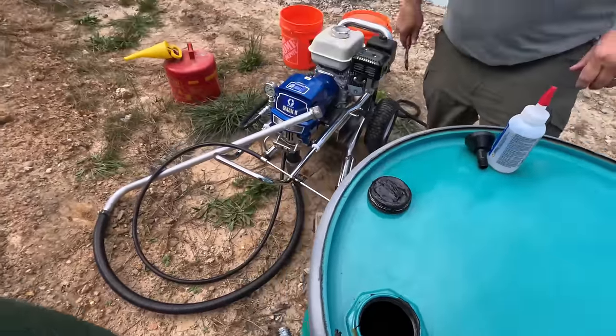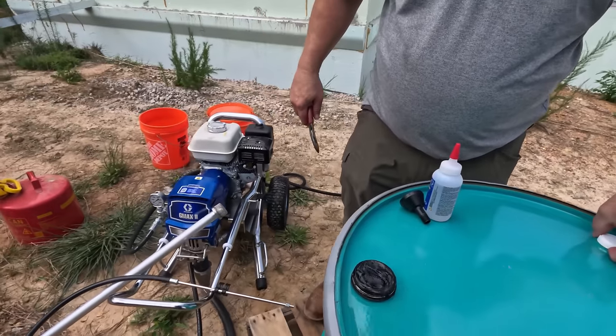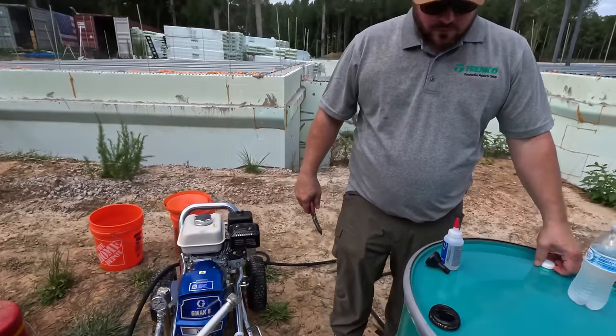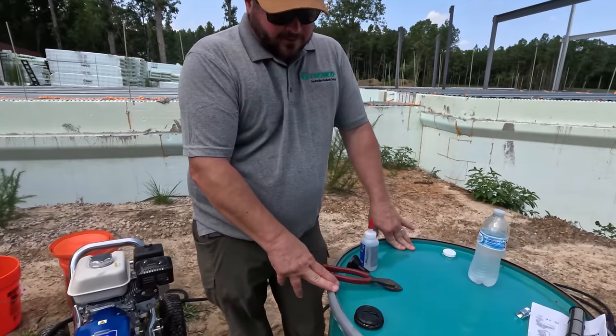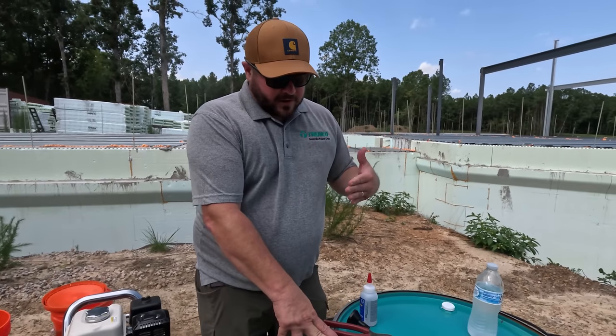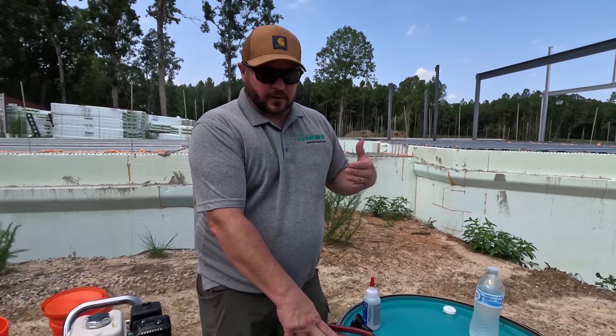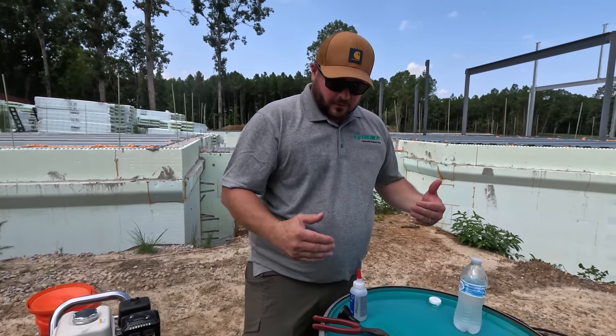So this is the Tuff and Dry H8. This is sort of our flagship residential waterproofing membrane here. This product itself sprayed on, just membrane only, comes with a 15-year warranty. When you use one of the drainage boards or protection boards, we offer a 30-year warranty. This product is going to go on at 60 mils thick.